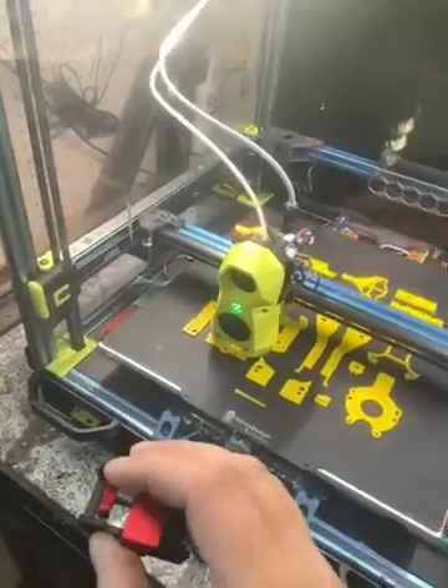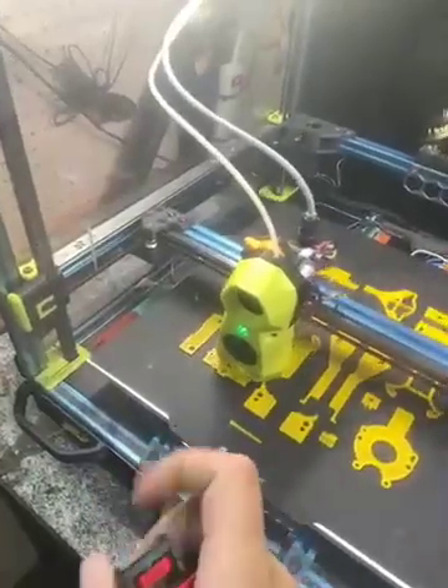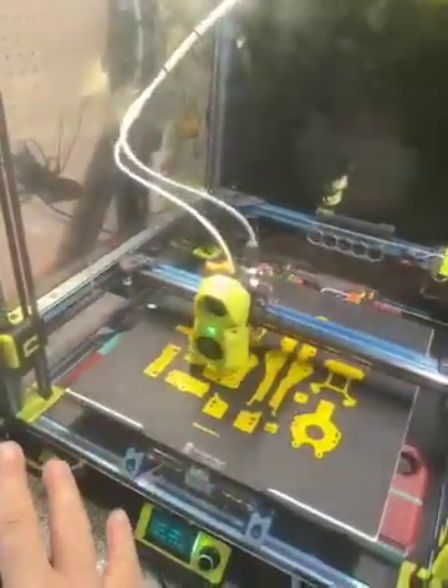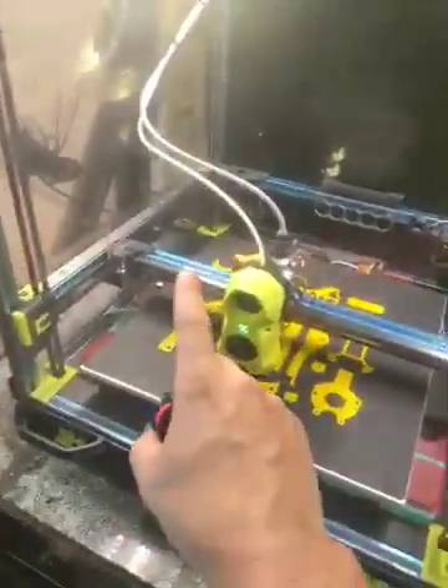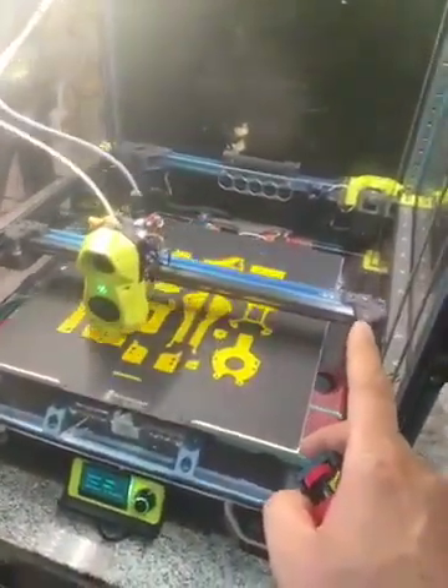Just mark quarters or whatever so you know, like, 'oh that's a half turn' or 'I'm going the wrong way.' Let's assume you're not mechanically racked — that your Y extrusions are parallel to each other, your X extrusion is perpendicular to your Y extrusions. We're also going to assume you're not too tight on your front idlers right there. If you're too tight on these it'll throw things off, but your issue is more in Y.